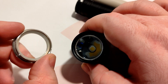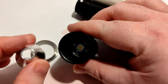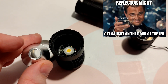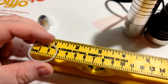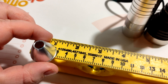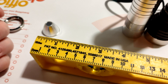There's the lens and the reflector. The reflector hole is only 9mm — although it looks pretty big, it doesn't actually fit around the XHP 70.3. So if you don't use the HI model, the LED gasket will probably hit and get stuck on the reflector — keep that in mind. The lens measures about 30mm, so the reflector outer edge is also 30mm, with maybe 28mm on the inside — slightly bigger than something like an MS21A.